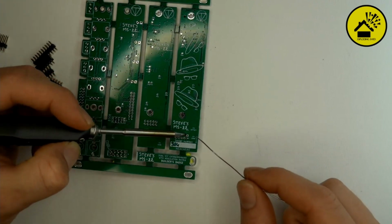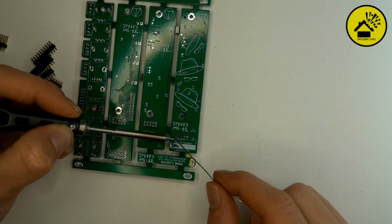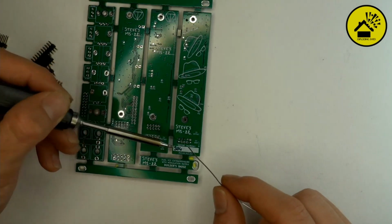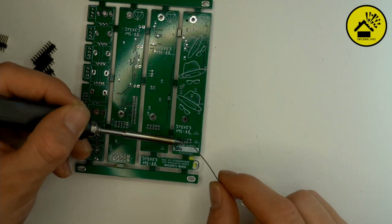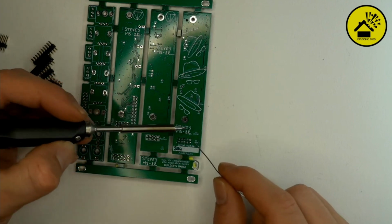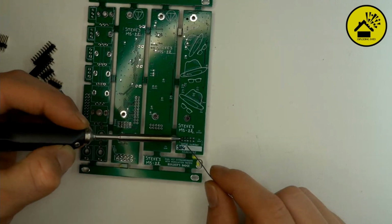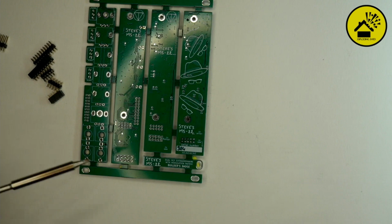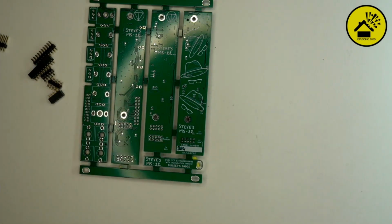I mean, with this DIY kit, and also the one we did last time, the Transient 4R, space is an issue, and there you really need a small soldering tip, a handle style tip, not the screwdriver type. Yeah, the key is not to use too much solder, because then it will give a connection to other points. Then you get short circuits.